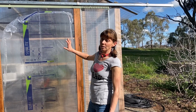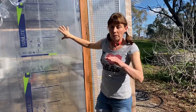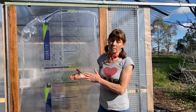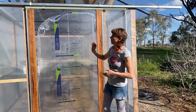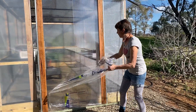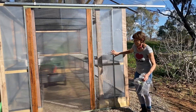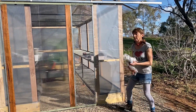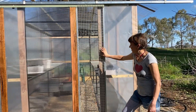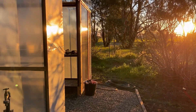Now we unveil the new greenhouse door. It's a polycarbonate sheet, and unlike the roof sheet, this one has the instruction 'install this side up/outside' on both sides, so either side can be exposed to UV — it's got protective plastic on it which you leave on while working, then peel off. The door is designed for ventilation: when you push it over to one side it allows airflow through. It's also anti-chicken and anti-snake — a special open/close venting design.